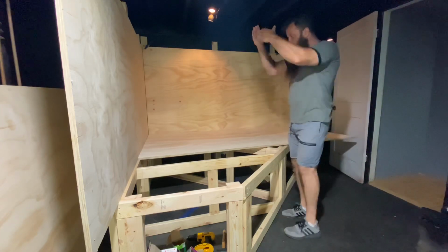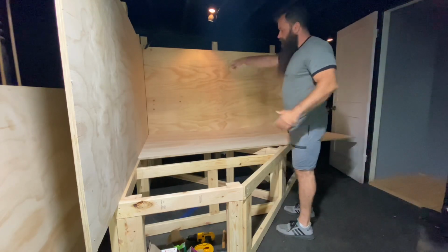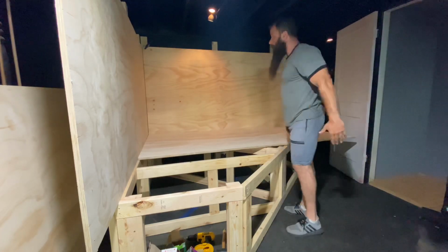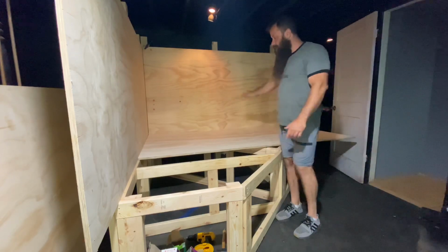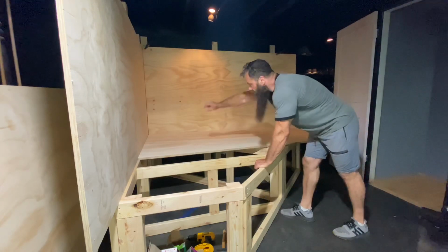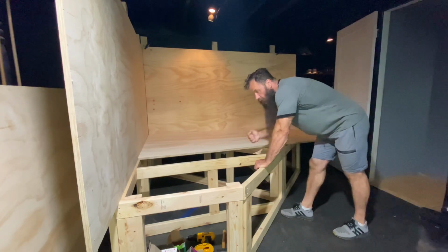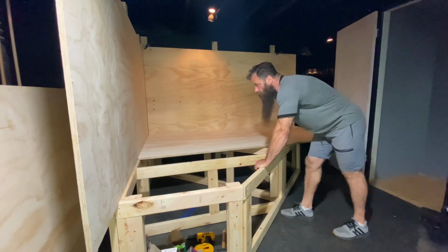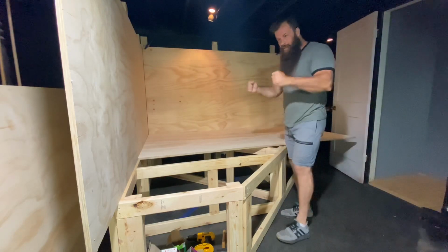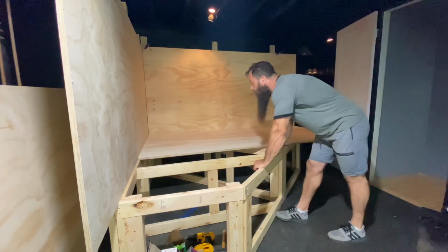I just want to adhere these two pieces and that one as it comes together simultaneously. We'll have to have a bead of glue this way and this way. Bada boom, bada bam, done. Then I'm going to run probably just a 2x4, but split in half on the inside to, like I said before, grab a few more screws into something meatier, to let the plywoods have a little more rigidity, or structural integrity, than just holding by their own self and glue and nails.